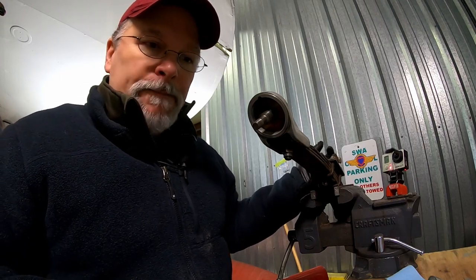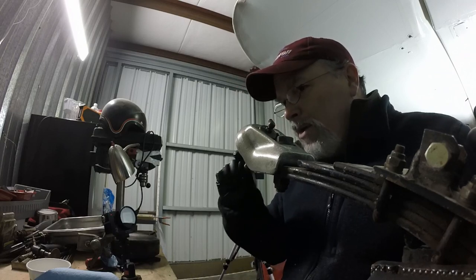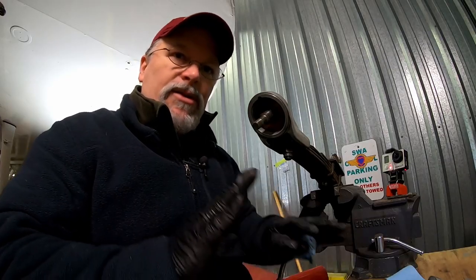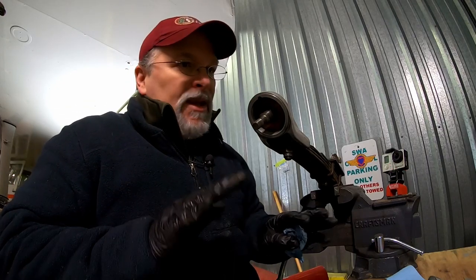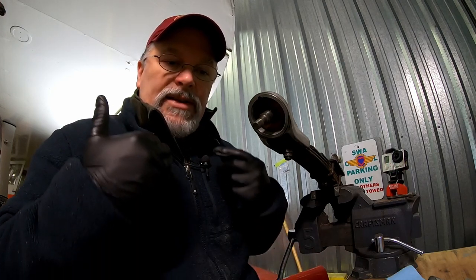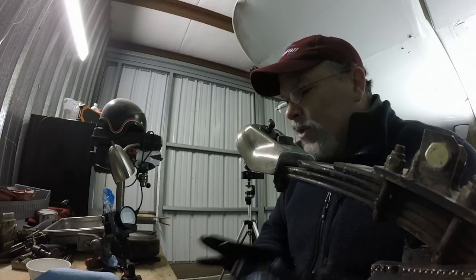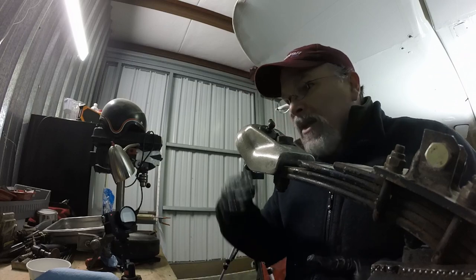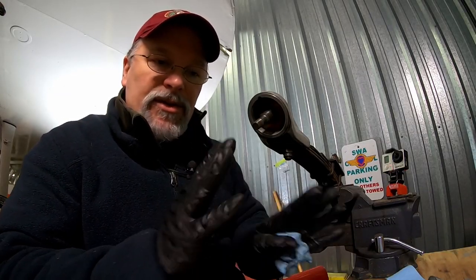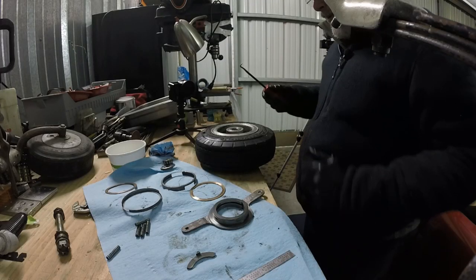However, the last time I flew it, I had the chains about one length longer, and it felt weird because it didn't feel as solid. As soon as I pushed the rudder, I would start getting some turning. This was a little more straight tracking, and I was less inclined to put in inputs that would cause me to go back and forth. So it tracked a little straighter, but it felt looser. And upon landing, that tailwheel was right down, centered up nice, and you could still see the rudder move just a little bit, and the tailwheel didn't budge at all.